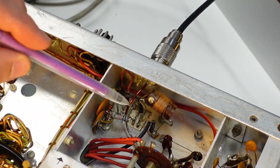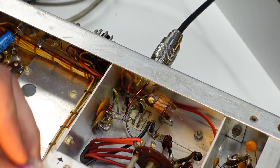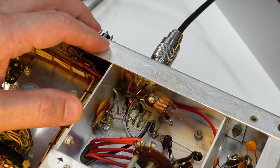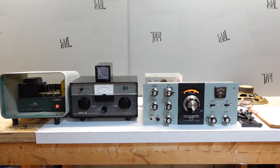To do that, I needed to replace the conductor from the relay, and I happened to have some 14-gauge enameled wire. Don't need the enamel, so I just scraped it off on both ends, soldered it, and it's all good to go. So it's time to see if this bad boy is actually going to output some RF energy.